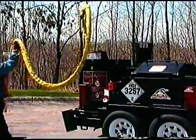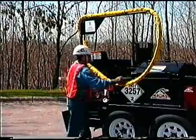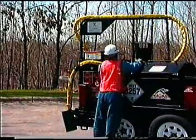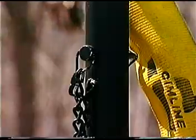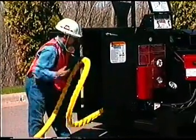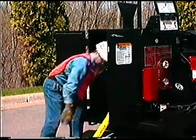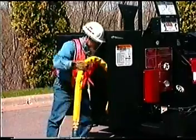Heated hose wand should be returned to the wand holder and secured. The hose boom is then rotated forward to the transport position and repinned. Standard hoses should be recoiled and hung inside the heating cabinet on the hook provided. Sealing tip should be removed and stored for the next use.